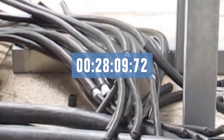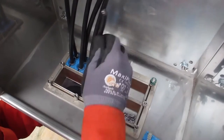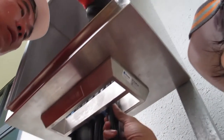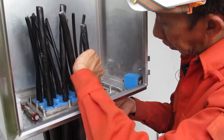After 28 minutes and 10 seconds, all cables are prepared. They now fill the opening with the cables and the sealing modules, half by half. There's enough space to let all cables enter from below. The modules fit the cables perfectly, and Peter and Lao can pre-compress regularly.